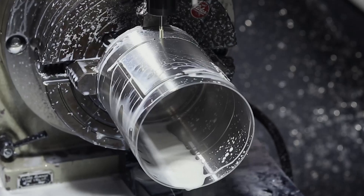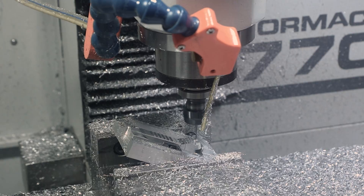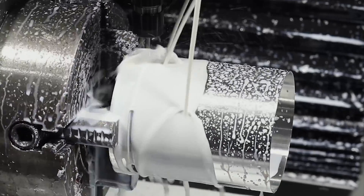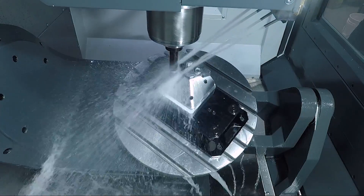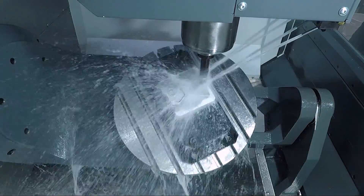In the nine videos that we've done on our part recap series to date, most of them cover things like three axis milling or turning, both of which are situations where your tool is perpendicular to your part and thus the size and shape of the work holding — that vice or chuck or fixture plate — didn't really matter because it was never the case that the shank of your tool or the tool holder itself would come into contact with the actual work holding device. Well, that all changes with fourth and fifth axis work because so often our part's going to be tipped over permanently or it's actually going to be moving dynamically. So we care a lot more about making sure the size of the work holding device itself is appropriate for the machine and the part we're making.